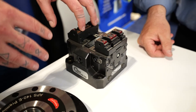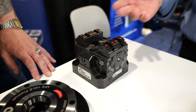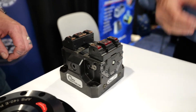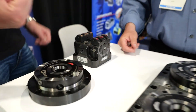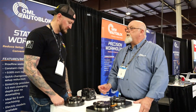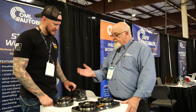A lot of people really like these Synergrip inserts. What makes them so different than anything else out there? We don't have to dovetail. We don't have to crimp the part. We can take the material right from the saw and clamp it right into Synergrip and machine 90% of your parts sticking up in the air. You don't need to stamp these — they bite just with a vise twist. Whether you're using a power vise or a manual vise, it embeds and impregnates into the part and forges a pocket, allowing you to clamp on less of the material and machine more of the material up past the vise jaws.